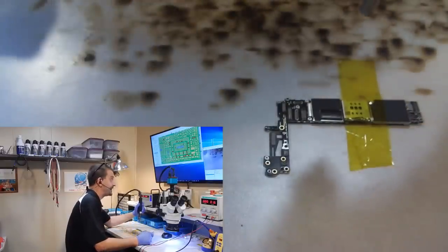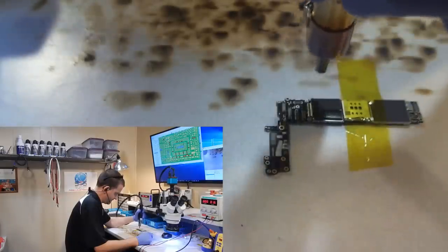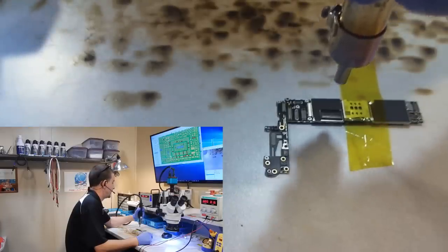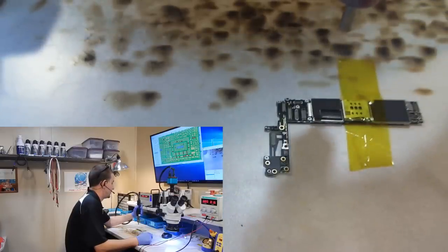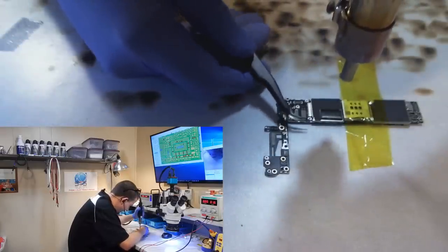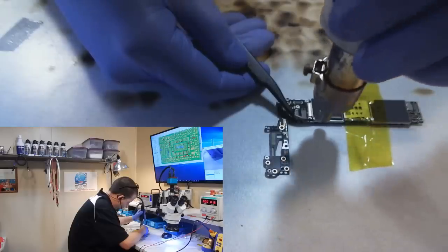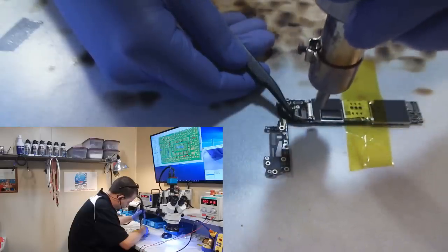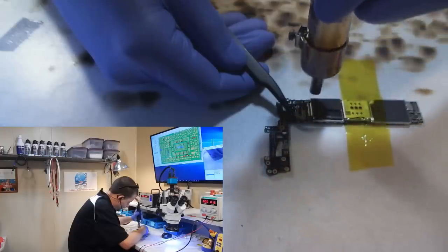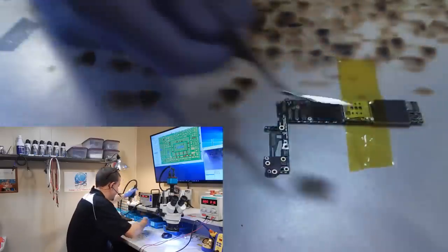I've got one hand on the bottom end of the board and my left hand on the top end. I'm going to say we've got a tiny bit more heat on the top end of the board than the bottom. This is 2 amps, and I'm talking a tiny bit of heat — you know it's a teeny tiny little component baking somewhere. Something should be turning black. My next step is to go ahead and pull the shield, since I did feel a little more warmth there.